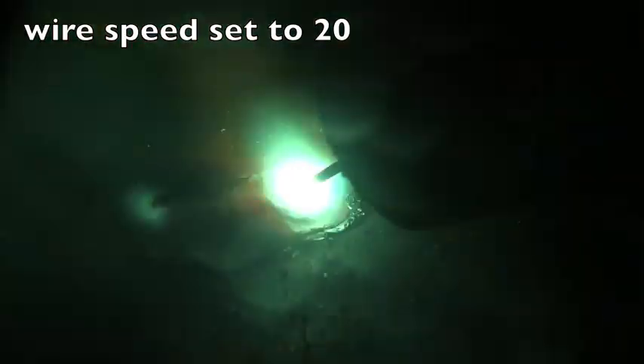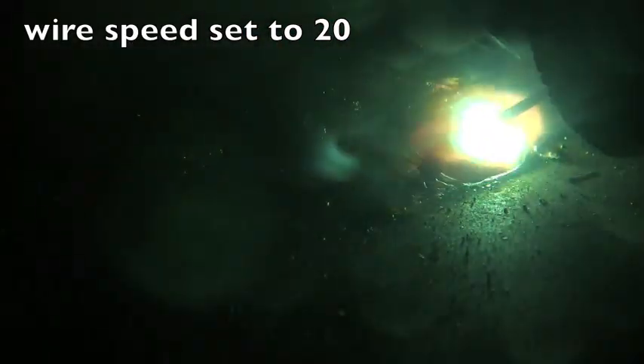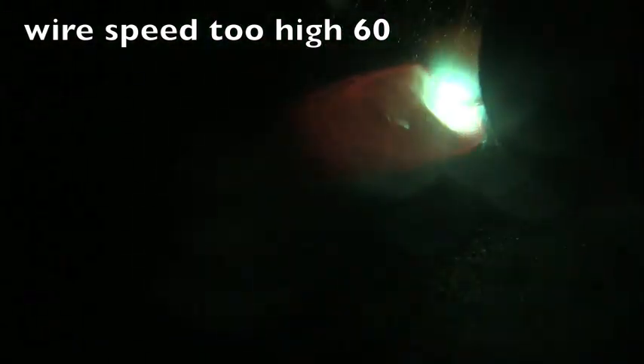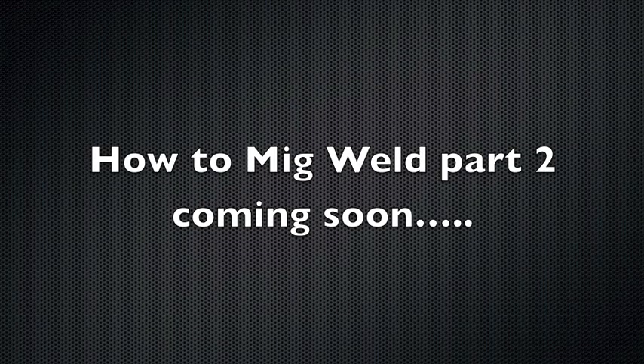Going all the way down to 20, you start getting a hissing sound. It's still welding, still got a puddle, but definitely not an efficient burn — nothing close to a bacon frying sound. That wire is burning off and almost burning back to the tip before it finally reaches the puddle. Now looking at too much wire feed speed at setting 60 — it's actually freezing the puddle, making it look like pudding or jello. It's more viscous because there's too much wire feed and the arc doesn't provide enough heat to make it wet out. More content will be coming soon — if I skipped something, leave a comment and I'll cover it. This series will go over different joint types and positions. See you next time.